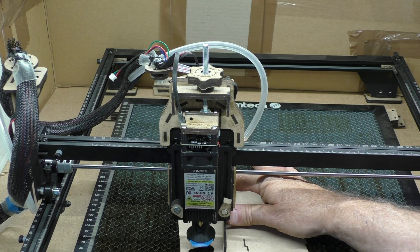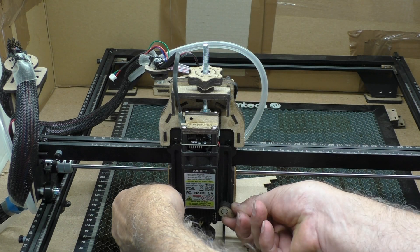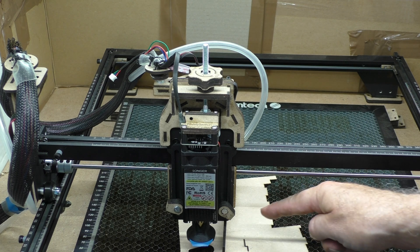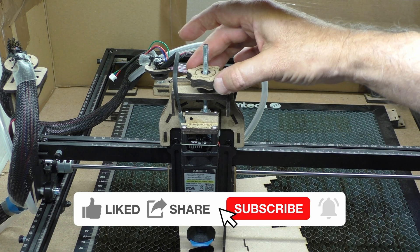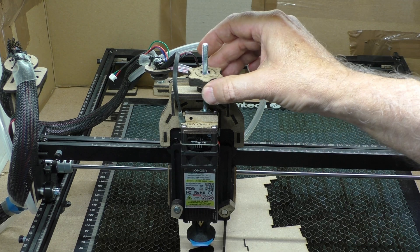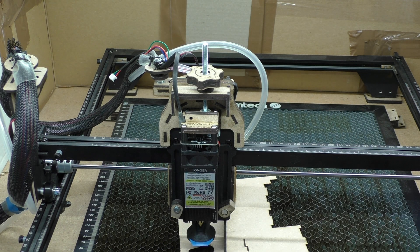21mm. I'm going to lock those down — you would use your thumb screws. That is a loose 21mm; the step gauge won't go up to 21.25, so that's where my knob is. I'm going to turn it — now that's 21.75mm. You can see you get a very fine focus adjustment, so if you need to come in or out of focus, it's so much easier.